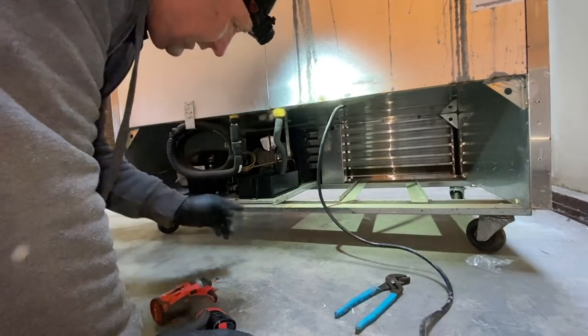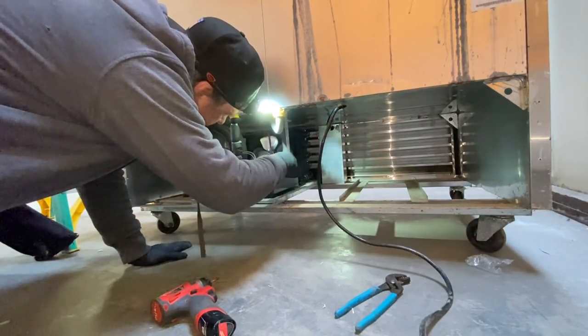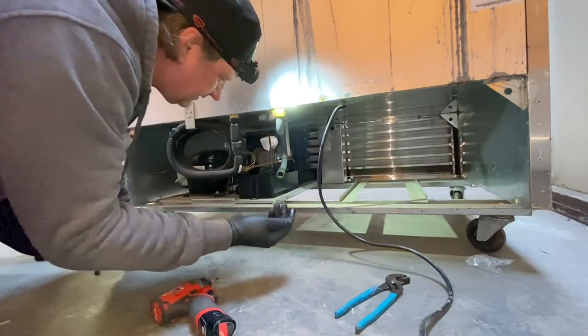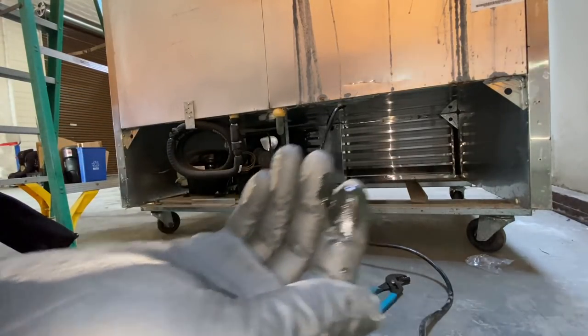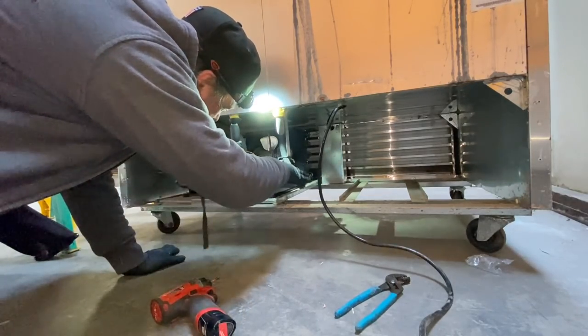The condensing unit's made to pull out forward, but since we can get to the back and the condensate loop is right here, see, look at all the oil, mega leaker. And you got, is that coming over on the screen? Yeah, condensate loop blew out big time.